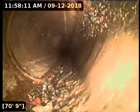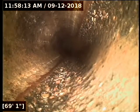Just looking down the roadway out here, it doesn't appear that there's a main lateral that runs all the way down in front of the house. That's why the line is going where it's going, I'm pretty sure. Which makes it a lot harder to figure out where responsibility lies with it. So, very important to contact the city and find out where they divvy responsibility. I would imagine at least to that transition there at 86 feet is probably homeowner responsibility.